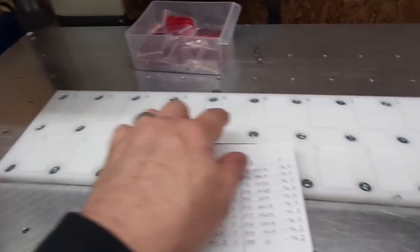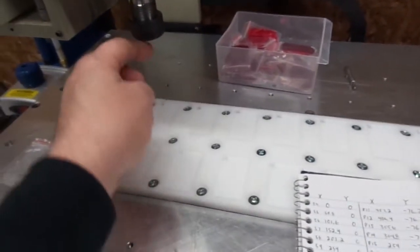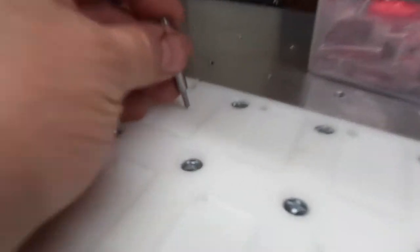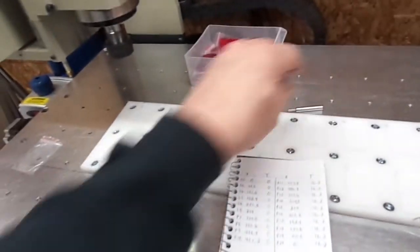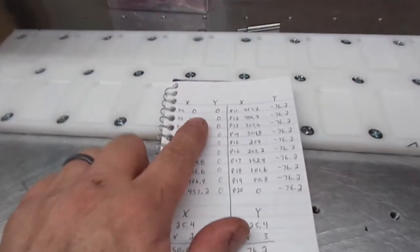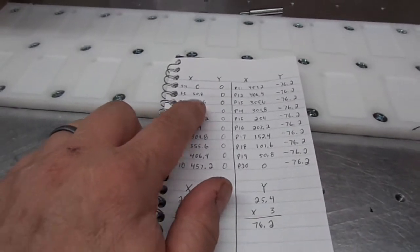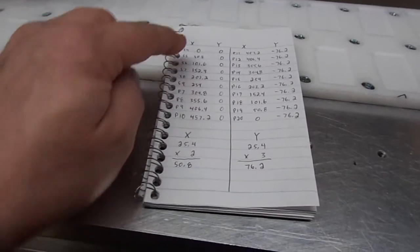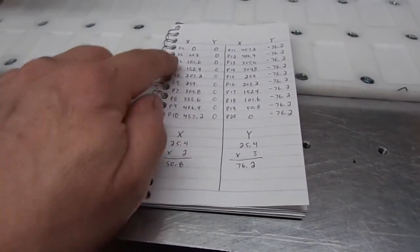I can start G54 over on this side if I want. Go down, take your bit, and center it in the drilled hole — that puts you dead center of the part at X0, Y0. Then just add 50.8 to each next number in line all the way down to fixture number 10, going G54, 55, 56, 57, 58, 59, P7, P8, P9, P10.